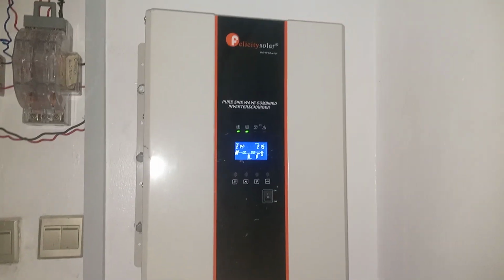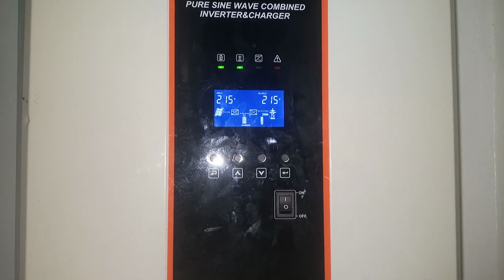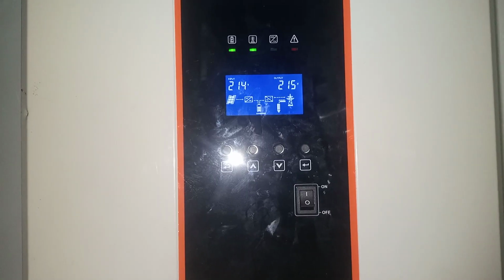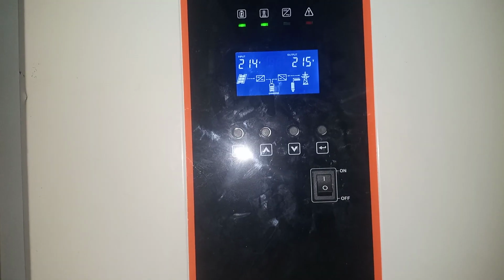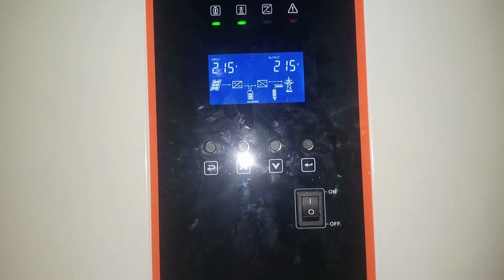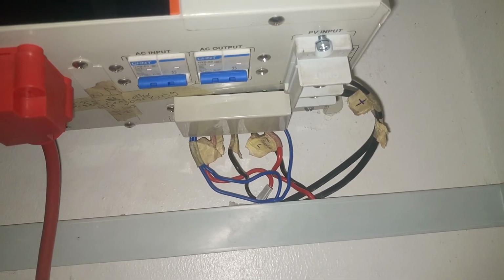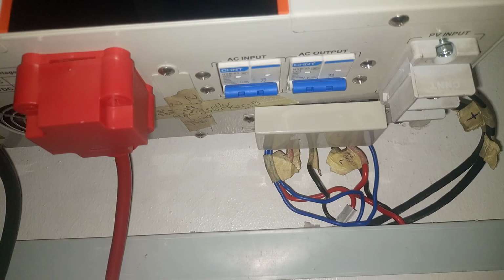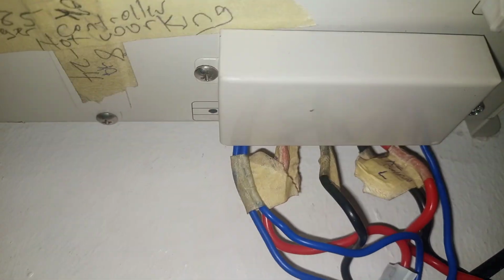This is 7.5 kVA hybrid inverter. So what makes it hybrid is that when you look at this inverter, you see that it's actually charging with the utility supply, which is the input AC, and again the panel, which is the one that comes from the panel. You see this panel symbol here, and you see that this point is output. You see that there is input, there is output, meaning that this inverter is on. All right, when you look at this inverter also, you see that it has a port whereby it comes with PV input. All right, PV input. And when you look at this, see that there are 2 breakers here, AC input breaker and AC output breaker. And when you look here, you see that this is output, the output terminals whereby you connect the output wire and you connect the AC input wire.